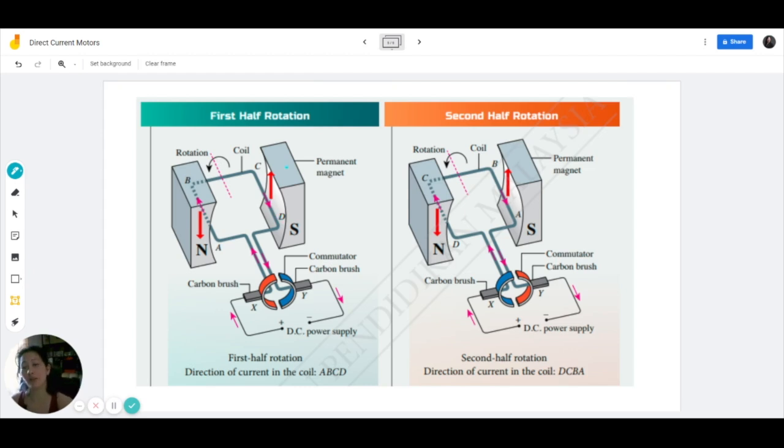For the left hand side, what we have is the coil ABCD connected to the power supply, placed between two permanent magnets, north and south. Here we've got the force on the left side pushing downwards, and on CD on the right side pushing upwards, so this causes a rotation that is anti-clockwise. The pink colored arrows show us the current direction. Now you must understand that when the coil rotates and does a half rotation, the left side AB is going to go to the right side, and CD is going to go to the left side. So in the diagram on the right, ABCD have exchanged positions — AB is on the right side and CD is now on the left side.